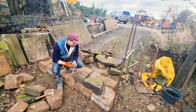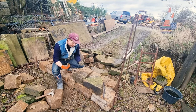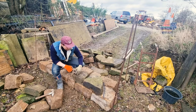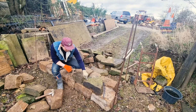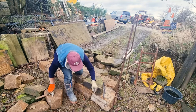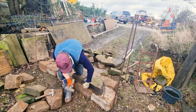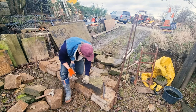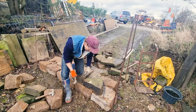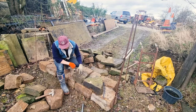The main thing, well, there's obviously a lot of main things, but something to look out for when you're walling is that you can place a stone on top of these. I think from that point to that point, we're level. That's a bit high. With big stone, I tend to use hammer and chisel. If I were just using nice size stuff, it'd be a cardinal sin to use a chisel, but big stuff don't really move around. And it's a little hammer, can't really do much to it. So, yeah,